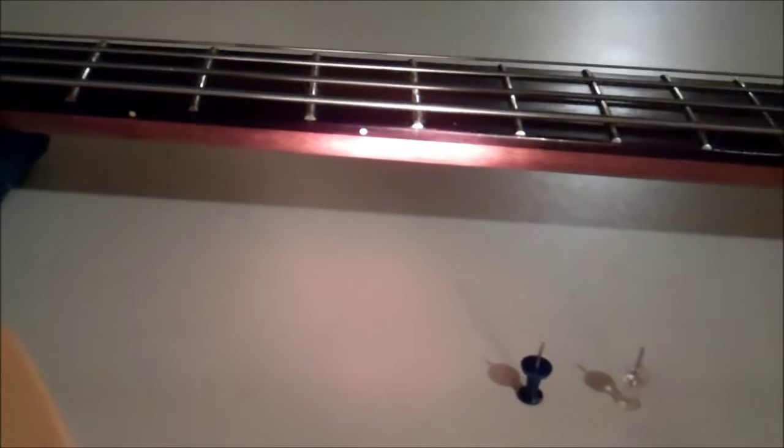That's what I'm going to demonstrate how to do. Now I'm going to show you how to drill the holes. I'm using DeWalt pilot point drill bits. If you're drilling side dots on a guitar that didn't already have them, you'd want Brad point drill bits — there's a site that sells ones intended for luthiers, and I'll put that link up. What I have here is a 5/64 drill bit, which is very close to two millimeters.